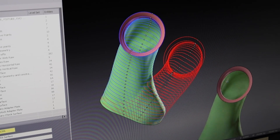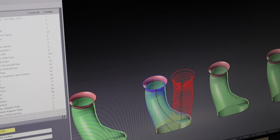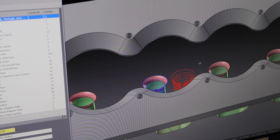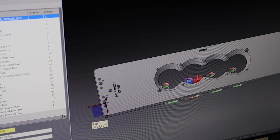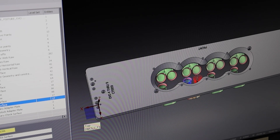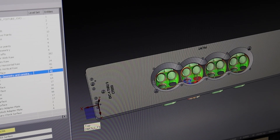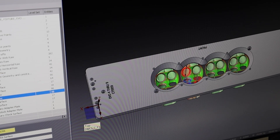You're probably thinking, how does it even know where to go? Well, it all stems from the plate. The plate is what the head bolts down to. Once the head is bolted down to the plate, these bolts here go into the machine. The cylinder head bolts to the plate with regular head bolts. And here is your combustion chamber. That's the geometry of the entire plate and how it relates to the cylinder head.